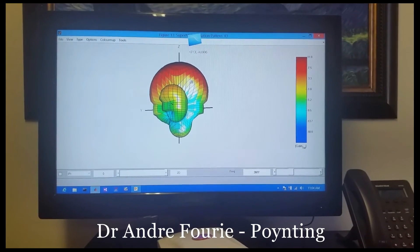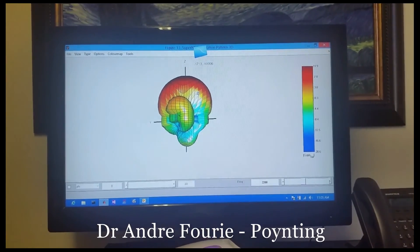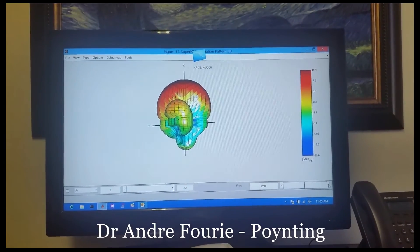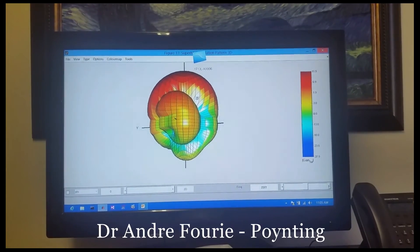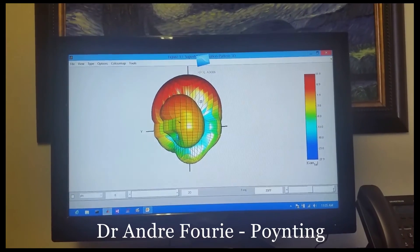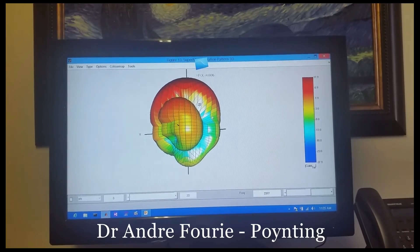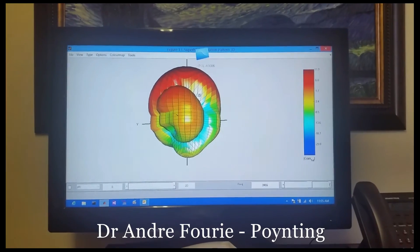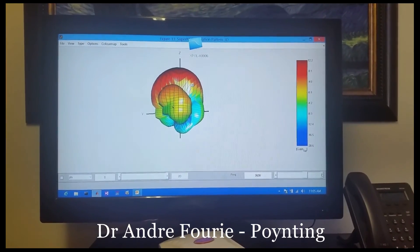At the UMTS band the gain is very much the same, a little bit higher, with the pattern maintained in the same shape. At 2.2 GHz the pattern is sitting at almost 12 dBi and well maintained. At 2.3 GHz, even though it may look a little ugly, gain is sitting at 12 dBi and the side lobes are still below minus 10 dB — quite low. That is also the Wi-Fi band, close to 12 dBi.